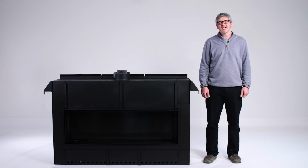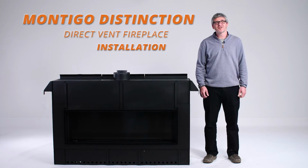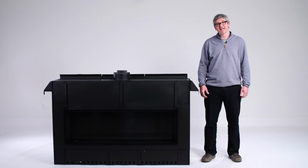I'm an NFI certified expert with Woodland Direct, and today we're going to talk about what you can expect with the installation of a Montigo Distinction direct vent fireplace. The first thing we will install will be the cement board. The cement board will come with your fireplace and it will come in 4 different pieces. You will install one on the top, the bottom, and each side, and they will mechanically fasten to both the fireplace and your framing. Now with the fireplace secure, let's take a look at the venting.